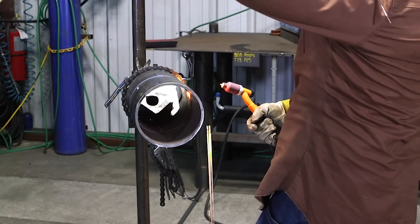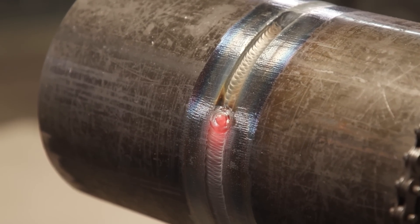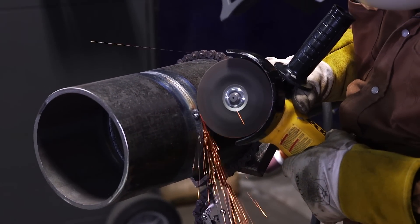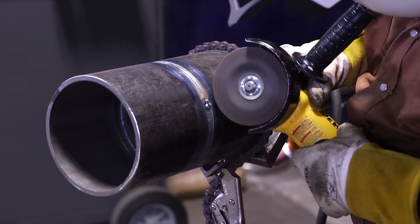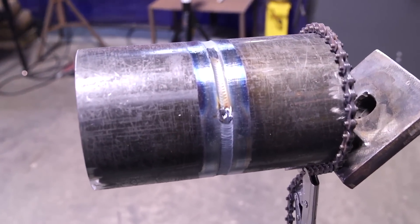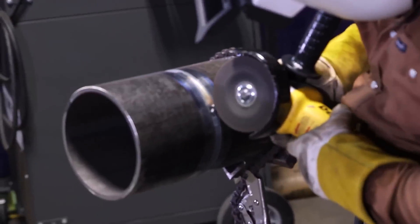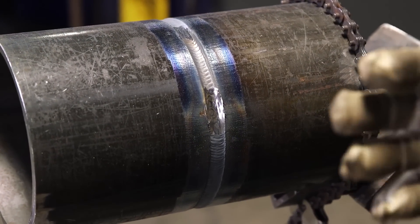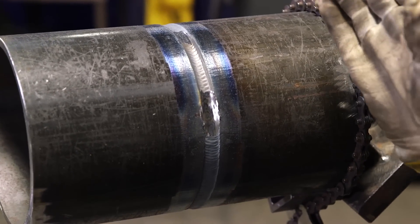As you can see, we've got a lot of porosity right there. We're going to have to dig pretty deep, make sure we get it all out, and then rebuild that fill. I'm going to start digging it out. You can see how far that porosity actually went down in there - it's very deep. So we grounded it out. To double check, I'm going to hit it with this wire wheel. If there's any metal that I smeared over with that grinding disc, it should pop out here with the wire wheel.